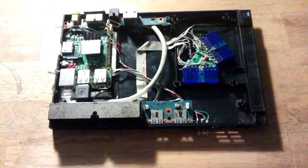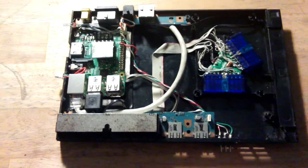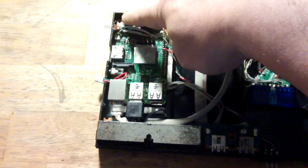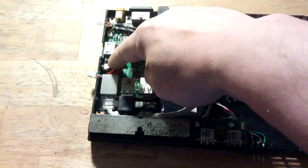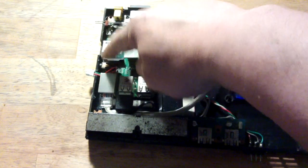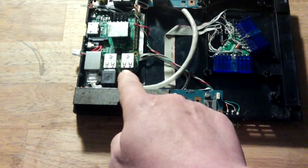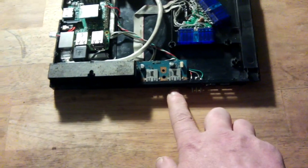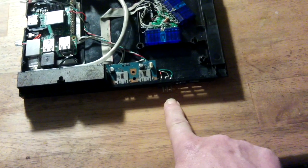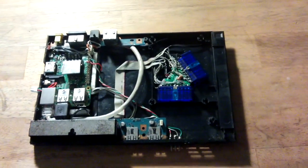There we are — the internals of the finished Pi Station 2. I've tied up the wiring and fixed up the heatsink to look a bit better. It doesn't really need a heatsink except in 100 degree weather. We've got Ethernet on the back, power input that reuses the one from the PlayStation 2 as originally, audio output, HDMI output. There's also a TV output — CRT type. A spare USB in case internal Wi-Fi is required, two inputs at the front for plugging in controllers or Wi-Fi, and the N64 controller input. And the two PlayStation controller inputs courtesy of that adapter. All done.